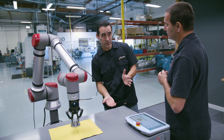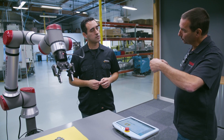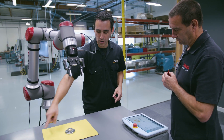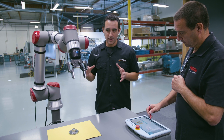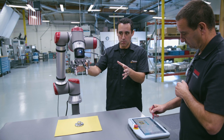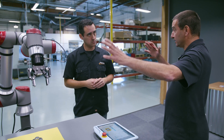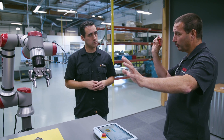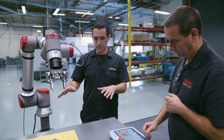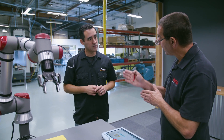We might use this in a lathe application — one part we definitely want to automate. We do multiple stacks in the bin. Do I tell it once you've picked 16 parts you're on a different plane, or how does that work? Once the camera detects there are no parts left on a level, it automatically detects that and removes that plane and executes the next one. Nice. Now here's my other question — this is about the size of one of our pallets. I want it to pick up the part right in the middle of the pallet regardless of orientation or position. Is there a maximum range or size this camera can handle? It depends on the size of the part. At really far distances we have a larger field of view, so we can have multiple parts, but if you have a really small part, some cameras may or may not see it — it depends on the size of the part and the distance. And it's possible to orient it — if it were picking up a prismatic part that was twisted, it would actually find the X, Y, and theta of the part.